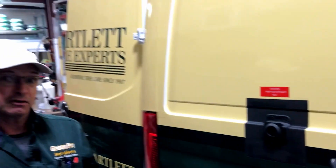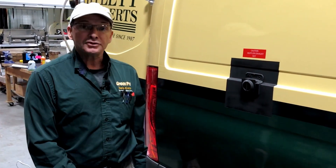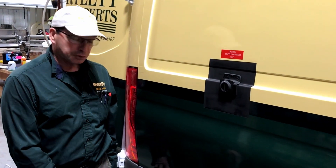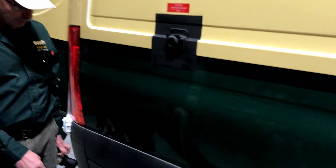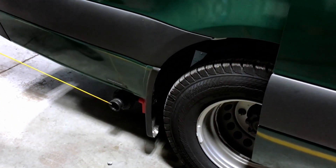This one here only has to be shut so the residual water left in the line does not spill out after the fact. Now the fill system here can be used by using a hydrant if you have a hydrant permit, a stream pump, or we can reduce from two inch down to garden hose if needed. So there's your fill system.